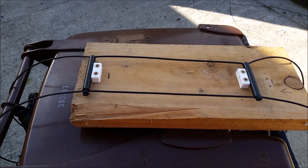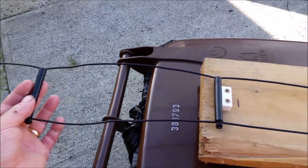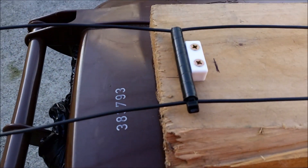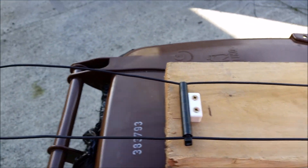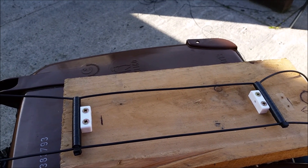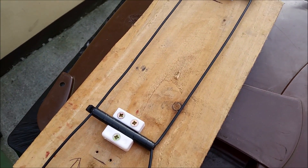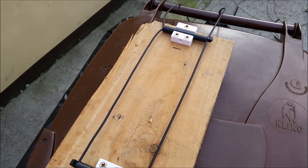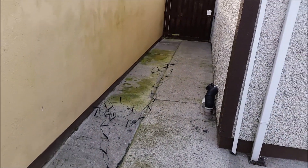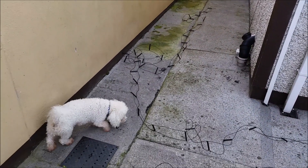I made up another jig just for spacing the spacers on the long transmission line. A zip tie goes through the far side, everything is nice and tight. Take me about half an hour or so to get this sorted out and ready to put it up. About an hour later, I made a little modification to the jig — put two more little corner clips on it just to hold the spacers in place. You end up with all of that, so let's get a couple of eyelets on to the end and get it up.